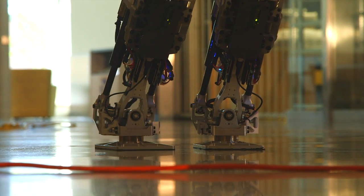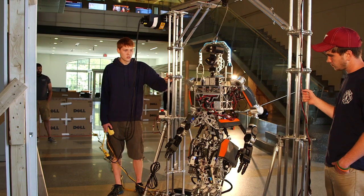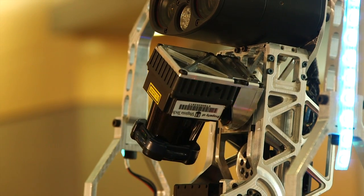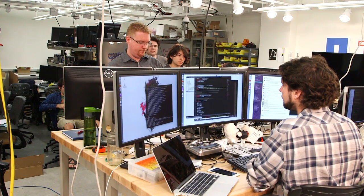The goal is to show that these robots are capable of working in real environments and improving the human-robot interaction so that they can become part of a firefighting team. What you see spinning in the front of the robot is our laser radar. It sends out a fan of laser range-finding data, and we get a distance map for various points, and then we start rotating that laser data, which builds a full 3D map of the world called a point cloud, so we can measure the distance to everything we're seeing.